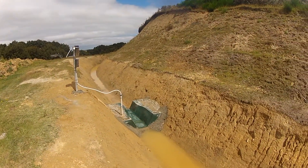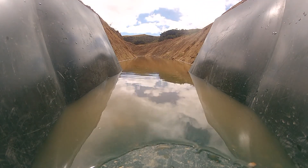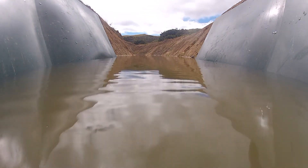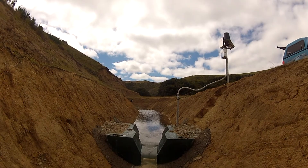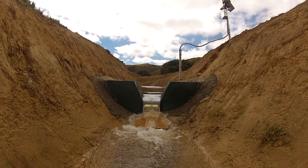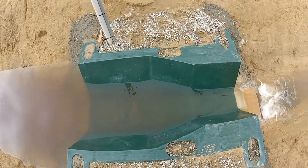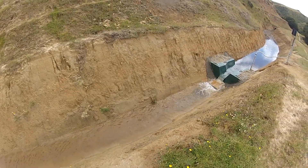The instruments have now been installed — PT — and we've opened the race gate at the top end. This took about ten minutes to fill. Flows are fairly small; we didn't measure it on this day but the creek we're taking from was fairly low. Once it had stabilised we got to see what the flow was like at the back end. The fall was quite nice and well aerated. It did form quite a big head pond above, but you can see it restricting here and working as it's supposed to, flowing away quite nicely from the tailwater.